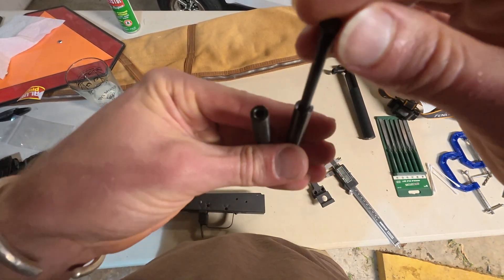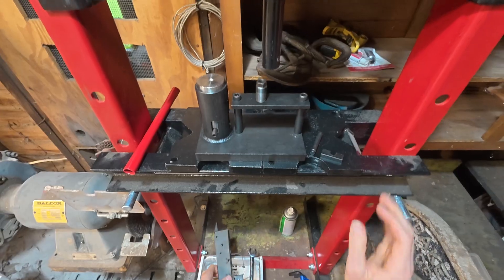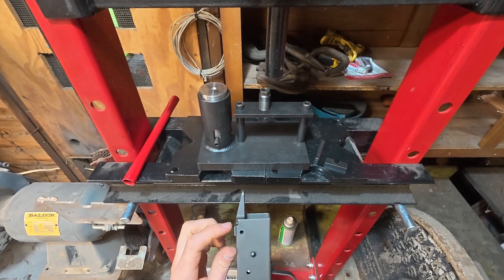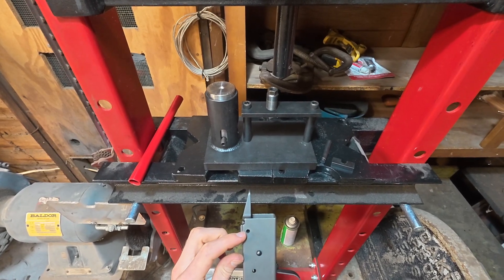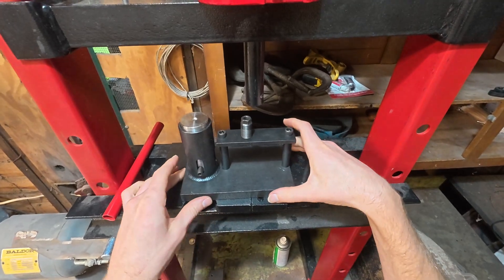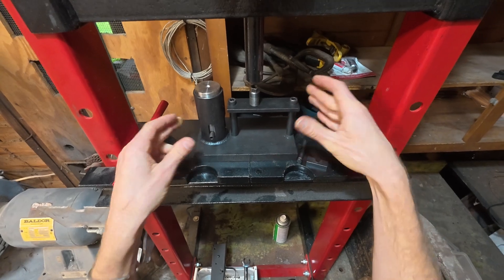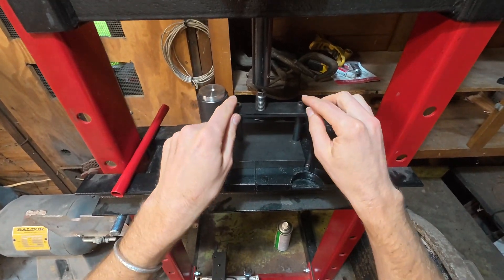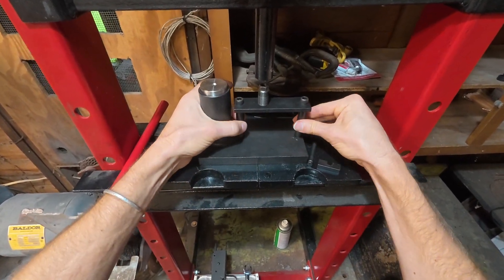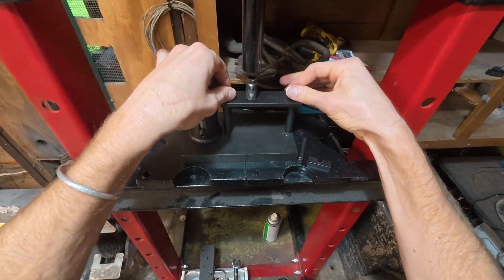You can see I've got the bigger size, which is 4.5mm, and the smaller one is 4mm. Now that we've made sure the rear rivets will fit in the rear trunnion area, we can set up our alternate base here that's in the AK riveting tool jig kit. There are basically two threaded screws down through here, and we've got these two supports — they're just solid cylinders that keep everything level.